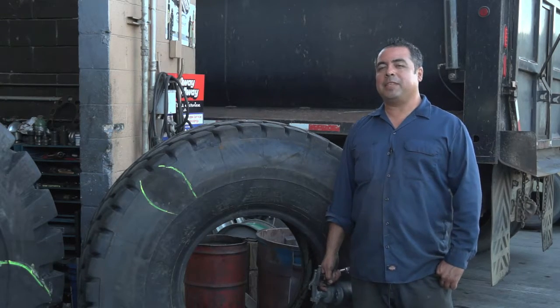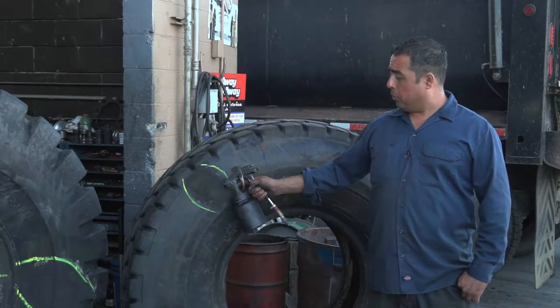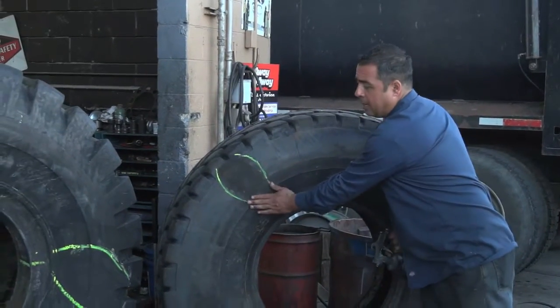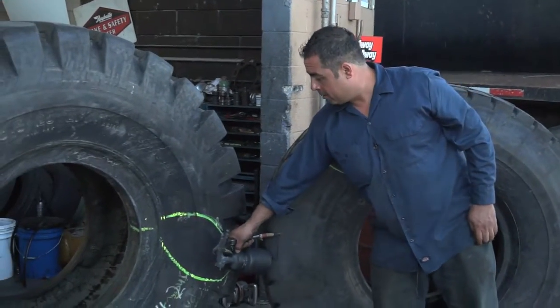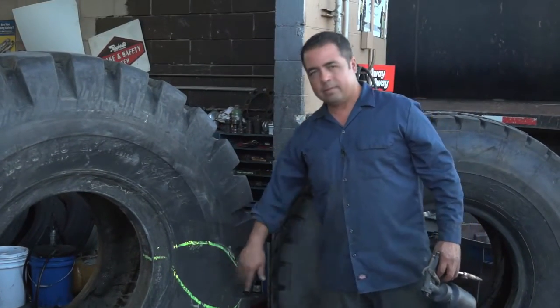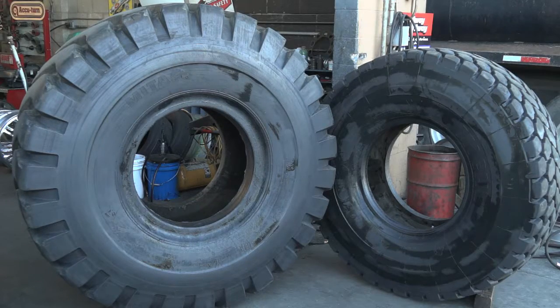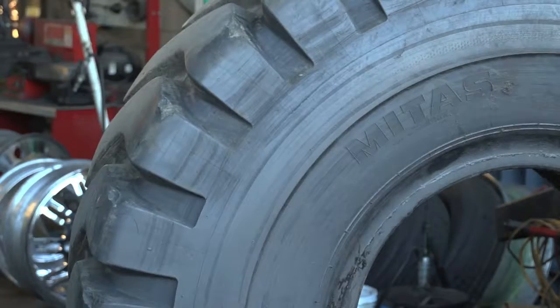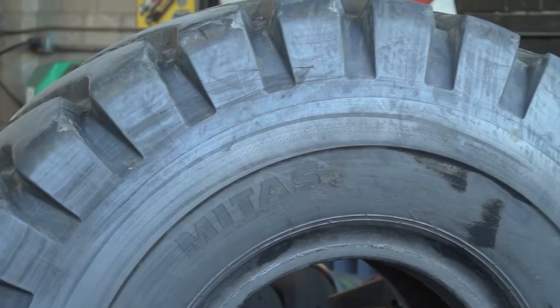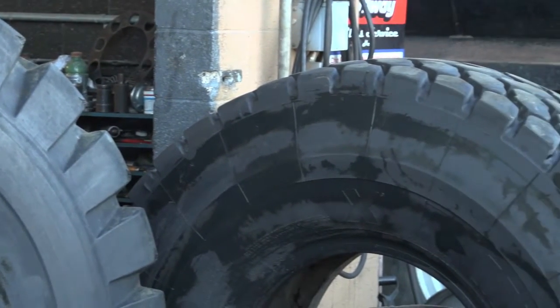You're wondering what the end result will be — well, here it is. This is the top shoulder repair, nice clean cut. This is the bottom shoulder repair, beautifully clean cut right here. That's the beauty of this kind of work. And here's the crown repair. Once everything's done, we'll spray them, make them look pretty. Even though they'll get dirty again, we always like painting them so they look like new, because to us, integrity and craftsmanship means a lot. And there you have it. We do a final inspection and we're ready to go back to hit the farm fields.